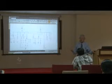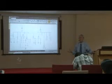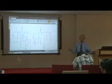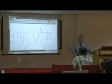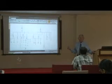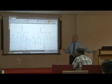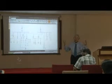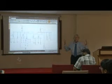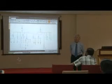Maybe you change the operating parameters, or the relay settings, or you see which variables you can control. You adjust them as best you can and try again and ask, is this better? If it's better, you're gratified. If it's not better, you try something else. It's hard. You have to have all of the data of your equipment so you know exactly how it will perform. You have to bear in mind that as the equipment gets old, it may not perform despite what the manufacturer says. And that again is a judgment call.